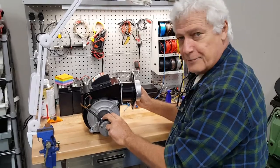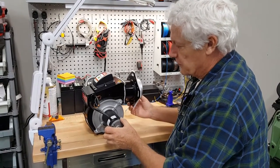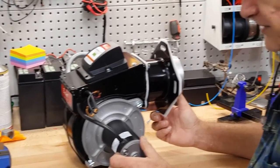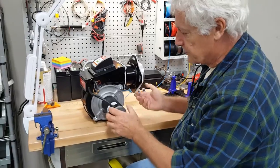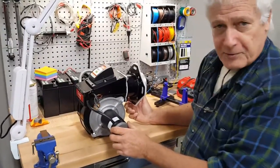This is a typical Beckett burner. It's an SDC model, and this is what we use in our pressure washers. It can heat up about seven to eight gallons of water on a regular four-pancake coil, and that's why we have a preference for this burner. It's more expensive than the ADC, but it's more capable.